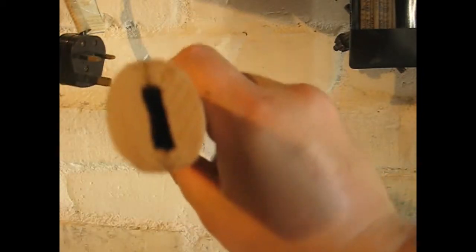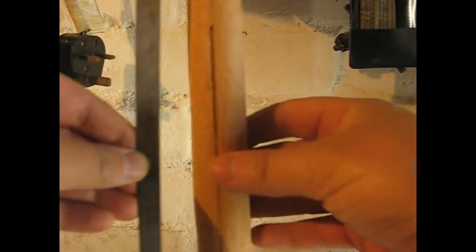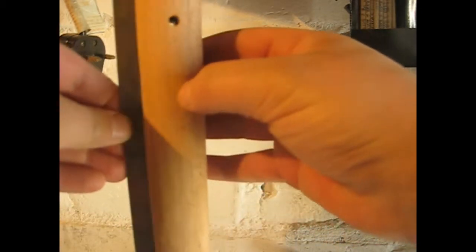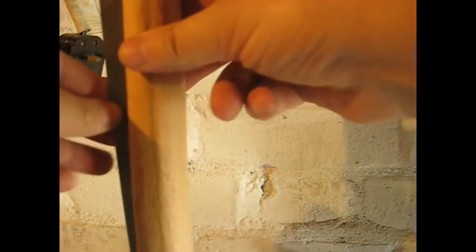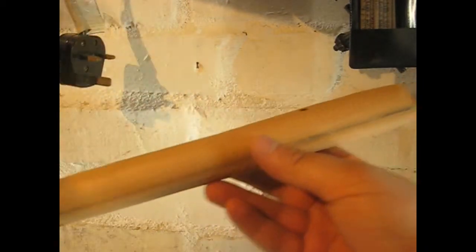So this is what we've been after — this sort of egg shape — and just trying to get it flat on both ends. What I'm doing is just going round and round, and you've got those high spots. I'm going to have to shave off a bit here. This is basically what I'm doing — just using the light to get rid of the high spots so it's nice and straight all the way along.